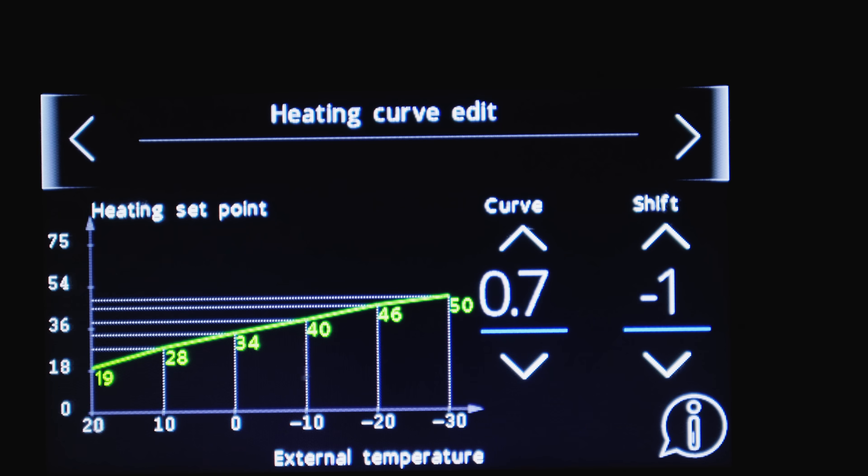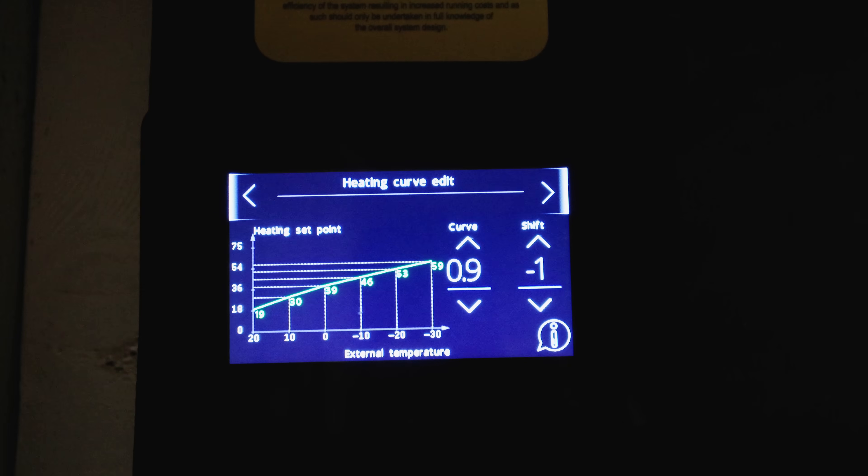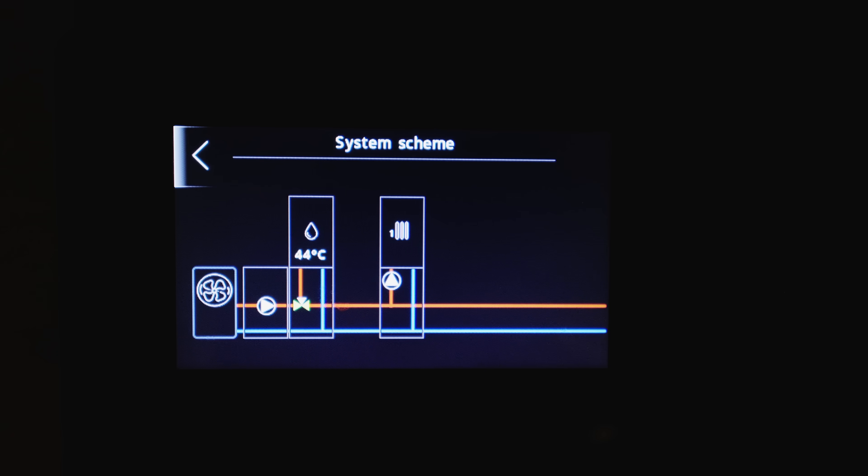Those are still the gold standard. What's missing: as of today there is no eco mode for hot water, which means the unit goes flat out when doing hot water — great for fast recovery, not so great for efficiency. The weather compensation setup on this controller is simply brilliant — you get a visual of the heat curve with adjustable slope and parallel shift, clear and easy to tweak, on par with Viessmann and Nibe, and actually a better implementation than the Vaillant Arotherm. While working on this video I got a firmware update from Grant — being able to use a micro SD card to upload new firmware to the controller means this heat pump will only get better over time.